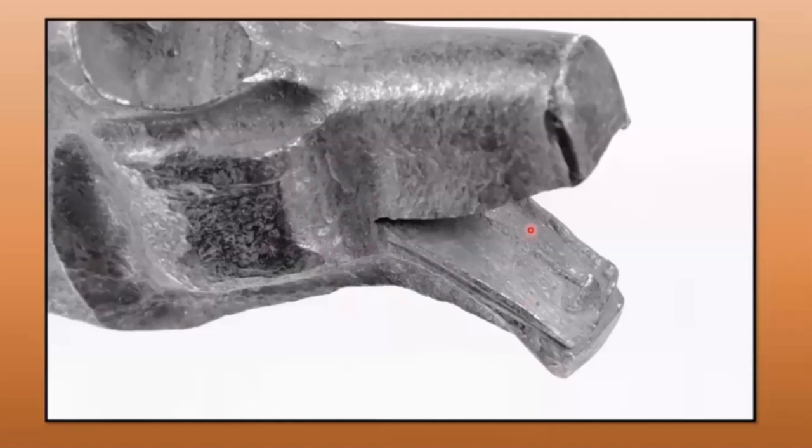So now what we're going to do is start working on this jaw. There's two things going to happen. I'm going to come in here with my normal hot cut, which has got a slight crown to it, so I can walk it around this. And I'm going to come in with another chisel, and I'm going to gather some material, and we're going to make a tong. But first, I want you to note, put a lot of effort into cutting around this corner.